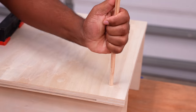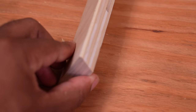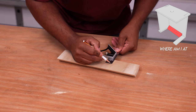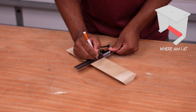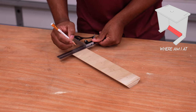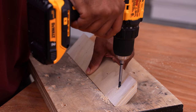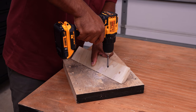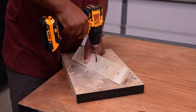As the router table started taking shape, a few ideas came to mind. I figured a small bit storage would make a great addition. I put holes already cut on both sides of this small piece of wood. Since I'm storing bits in it, I need to space them accordingly. I'll leave wide spacing between them since I'm not sure what I want to store here yet. I want the router bits to sit straight up and down when not in use, so the holes need to be as straight as possible. While holding the piece of wood at an angle, I drilled in the face first, then leaned the drill straight up and drilled down.